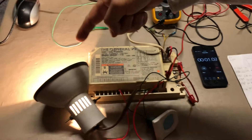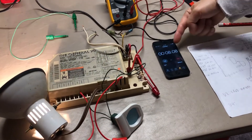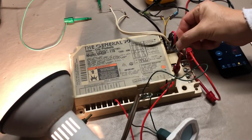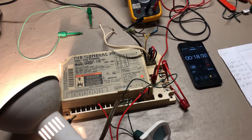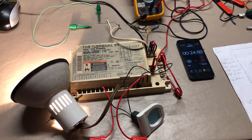The inducer fan blower turned on — that's represented by this light — and the timer started. We're going to jumper the pressure switch to simulate low pressure, and then at around 33 seconds the igniter will turn on, which is in about 10 seconds.